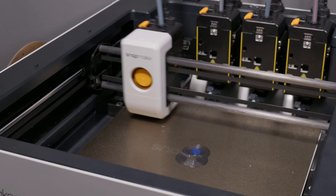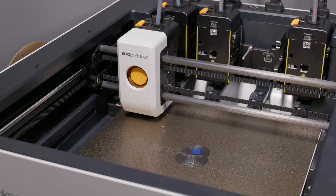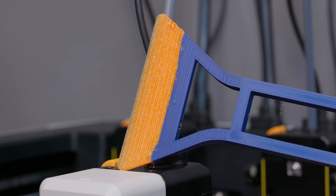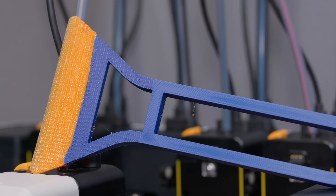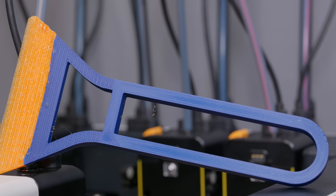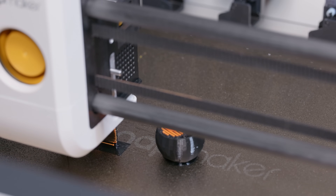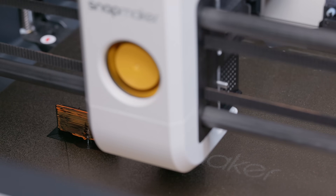Another advantage of a tool changer is the ability to swap tools instantly if you have the preheat set up correctly, meaning it can be true multi-material. TPU is a breeze for a tool changer — it poses no challenge whatsoever. I've even printed this ball with an offset PLA Hardcore and a Peba outer. Nobody's really talking about Peba because it's relatively new in the 3D printing scene — a video is coming out soon — but this thing bounces erratically, it's hilarious.